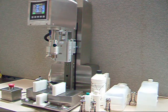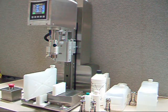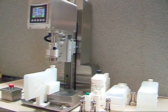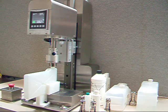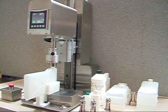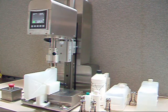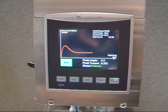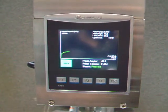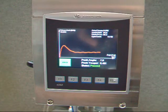I'm going to apply 10 inch pounds and then measure the removal torque. To start the test, you just locate the container on the platform and press the roll actuation start button. It will start applying the torque and then measure the removal torque, doing it 10 times — alternating a removal cycle and an application cycle. It goes up to 10 inch pounds and then measures the removal torque in a 90-degree rotation.